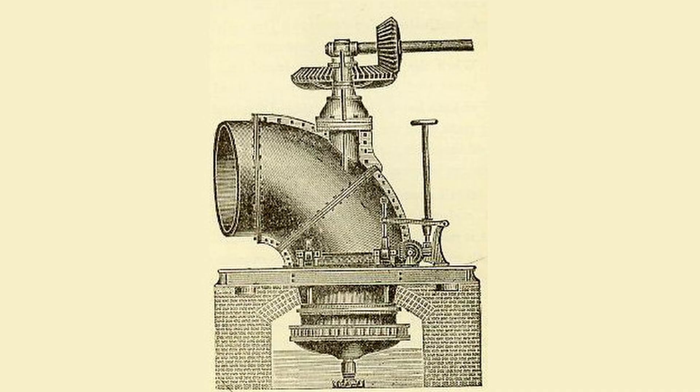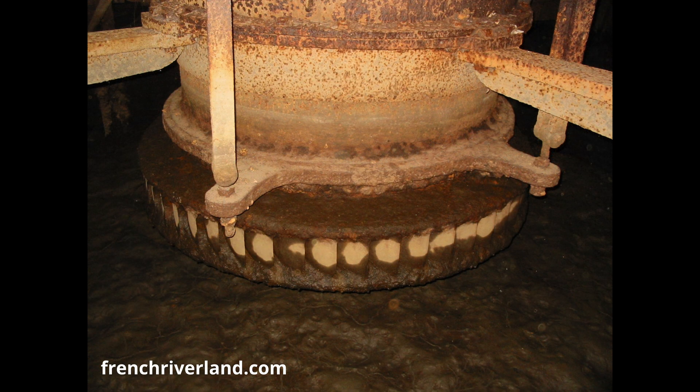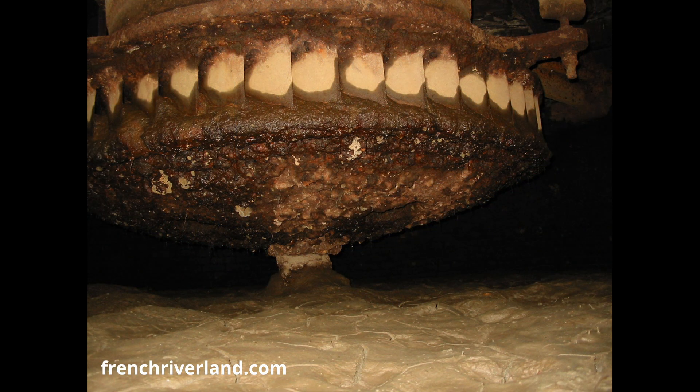The first practical turbines were invented by Benoît Fourneyron and were capable of producing around six horsepower. This one is actually a slightly improved version made by Claude Burdin in 1852. You can see the water comes in through a pipe at the top and hits the base, which has angled blades. The water sprays outward to the sides as it hits the turbine, and is then captured by the walls and ducted out to the stream or lake below.